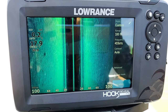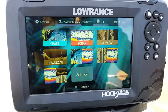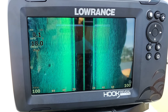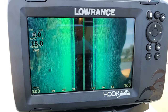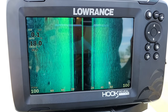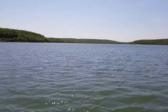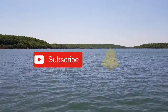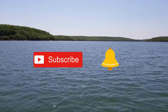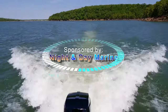That's really about it. One thing I didn't point out is that to get to this screen, you just press your pages button, arrow over to side scan, and press enter — and voila, it brings up your side scan picture. That's it for today's structure scan video. Thank you all for watching and subscribing to Night and Day Marine. Stay safe out there. If you enjoyed this video, please like it below, hit the subscribe button and the little bell to get notifications every time I release a new training video. And remember — when you watch videos from Lowrance Training Academy, the difference is night and day.